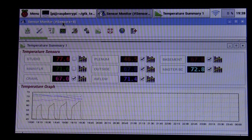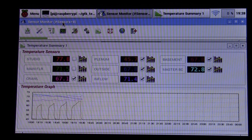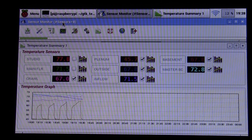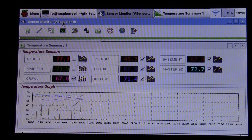The neat thing is the Raspberry Pi Zeros have built-in drivers to pull Dallas one-wire sensors directly, which is why I like them so much. The Dallas sensors are very accurate — they're so sensitive I can tell when I walk into a room and sit down for a while, because my body heat causes the temperature to rise slightly.